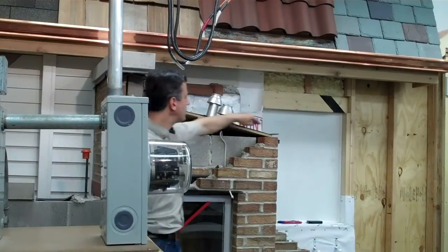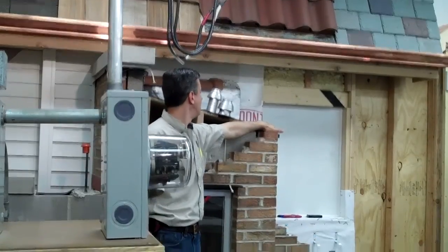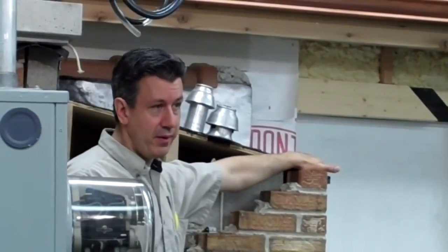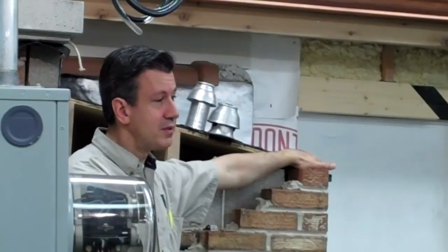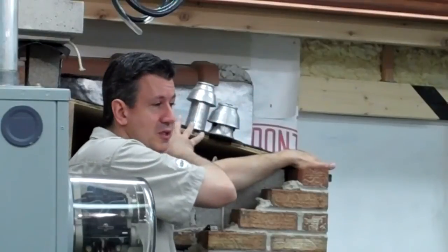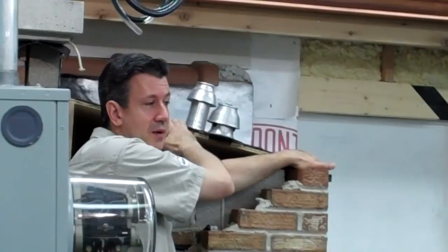When you have this rubber roofing, in Chicago most municipalities consider a roof complete with the reflective coatings of the radiant barrier. If you see it without it, somebody didn't complete the final roofing step. What that does is it reflects the UV rays of the sun, which limits heat exposure and extends the life of the roofing material so it doesn't break down as quickly.